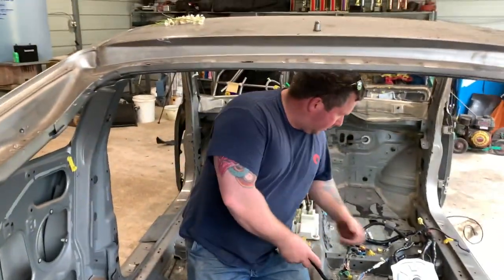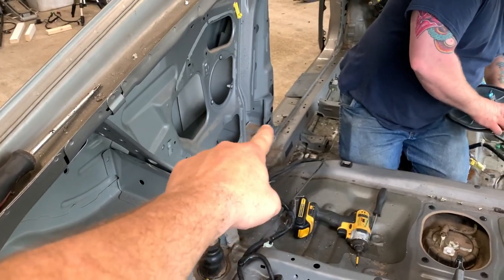The main part is just getting good prep — getting everything clean, getting all of the areas where we're going to be welding the bar in, getting holes drilled. We're going to try to do this without cutting the top off the car, because to me it's just mentally unsettling — the top could fly off. It's the easier way to do it, but I'm going to try to do it seamlessly. The majority of it is just the prep, and then we'll show you what we're going to do with mounting the cage to the floor.